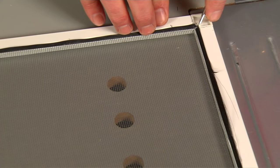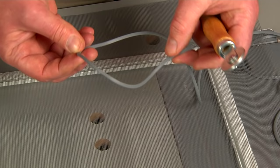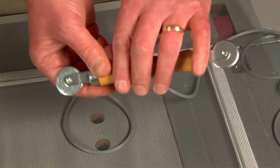If you have a larger tear, you'll need to rescreen the entire frame. To remove the screen, use a screwdriver to get underneath the screen's spline and pull it from the channel inside the frame. You may be able to reuse the old spline, but many times it becomes brittle. Make sure you bring the old spline with you to the hardware store so you get the right size. Now roll out the screen, allow it to overhang the frame, and use a sharp utility knife to cut it so the roll doesn't get in your way as you're installing the spline.